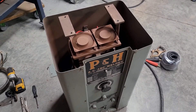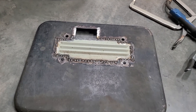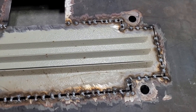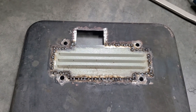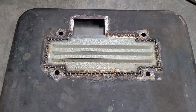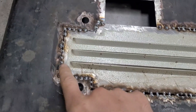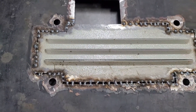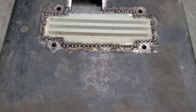I'll get that lid all fixed up and this thing's almost ready to use. I'm welding this louver in place now, installing it flush so I can smooth these welds out afterward and it'll look like it was supposed to be there. Pretty much the same concept as doing body work. I think this steel is 16 or 18 gauge, so it's a little thicker than a modern car. I'm just doing a series of tacks, changing positions for each tack — just going slowly. It doesn't have to look pretty.